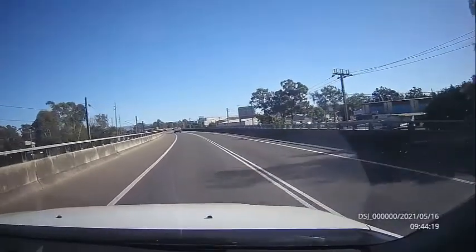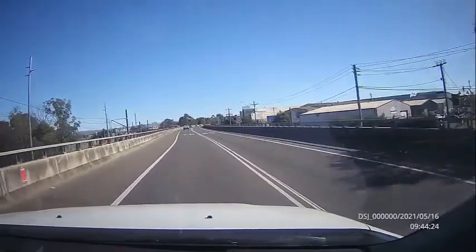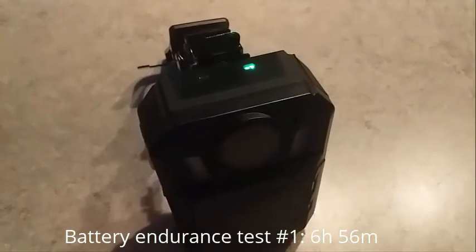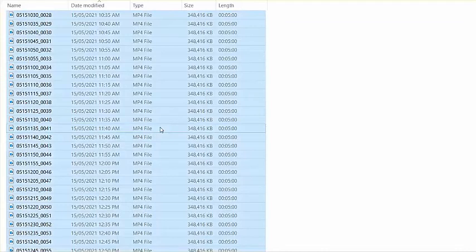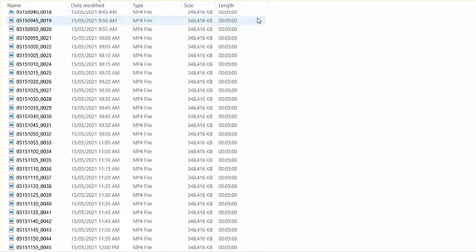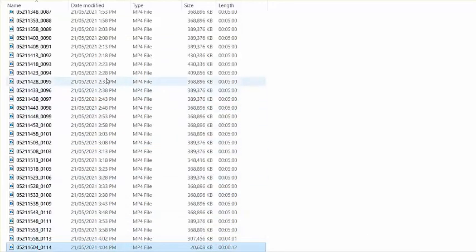The first test is to see how long the battery lasts. With the camera fully charged I headed off for a long drive and left the camera on continuous filming. Six hours and 56 minutes later the camera beeped and the battery went flat. At a resolution of 1296 pixels that produced 27.7GB of files. I selected these settings for the test. This was somewhat short of the 9 hours and 40 minutes that the advertising material claims for this resolution, so I ran another test.